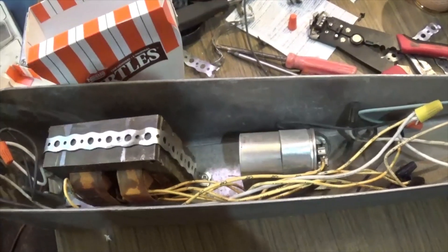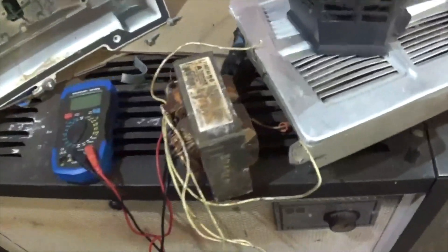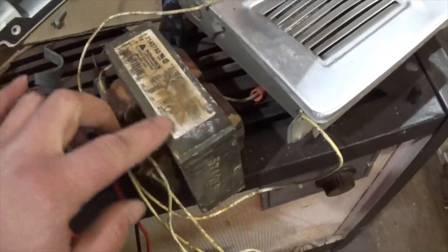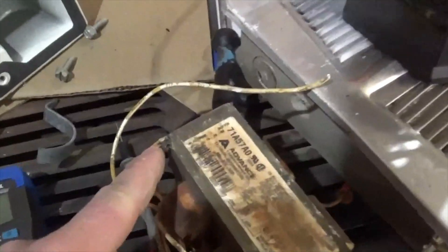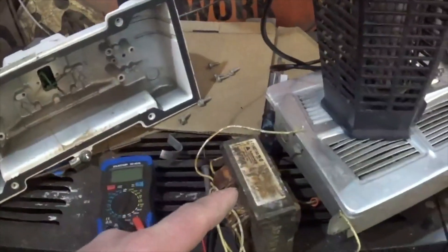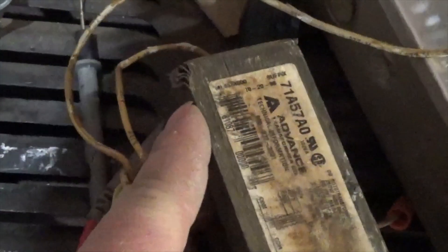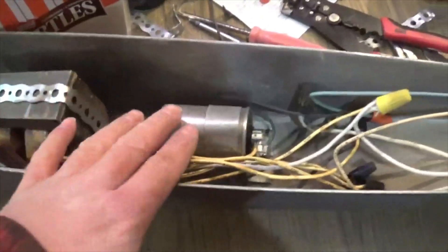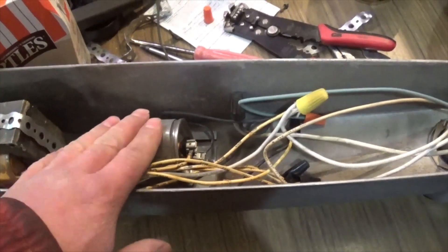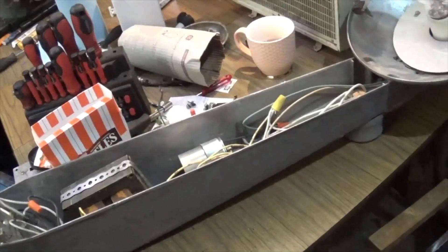Second ballast is wired in - I forgot to show the transformer before installing it, but the sticker looked way happier than the one that was in it. The original sticker is really dark and the transformer is still warm. You can see the original housing was beat up at the top, and this transformer came in contact with something previously - this replacement one is unharmed. I'm running its original capacitor, which tested the same as the original one in the previous ballast.